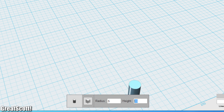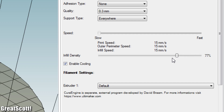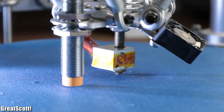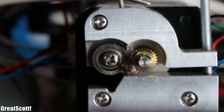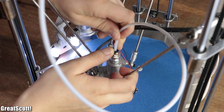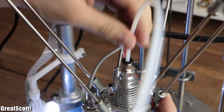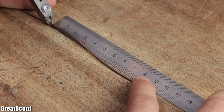So I created a bigger cylinder with 123D Design, which I wanted to use to find out how the resistance depends on the infill ratio. But no matter how often I tried to print, this cylinder never worked out. The reason is probably the Bowden extruder system of my 3D printer, which cannot push the semi-flexible filament with sufficient pressure and thus clogs the hot end. But even without successful prints, we can still test the electrical characteristics of the material.